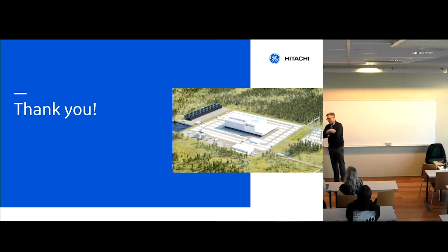So I can tell you about Sweden and Finland: they have a ship, right? And they bring fuel around to the 2 central fuel storage facilities, one in Olkiluoto and one in Oskarshamn in Sweden. And so for Estonia, that would be one way of doing it. In the US, every plant has these big, huge concrete structures that they sit in on site. So basically, you take this cask out of the building, and then you put it in a concrete storage facility on a pad. So in the US, we have no repository. It's typical of the US to not be able to figure this out because we can't agree on anything. So we can't agree where to put it. So everybody just keeps it.